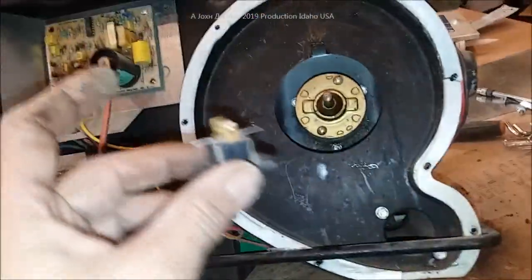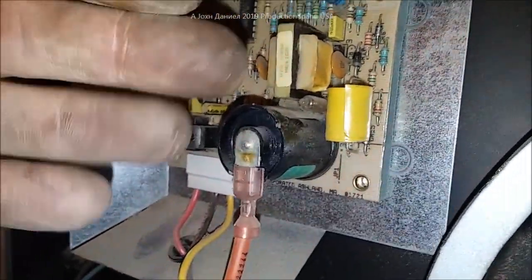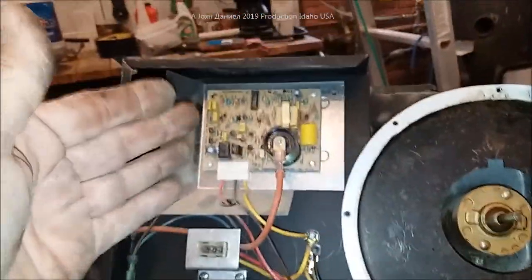Without that little item working right, nothing on your furnace will work. If you're wondering whether your igniter is working, there's a little neon bulb right over here — you can get a mirror, reach up inside the cavity, look in the side of the grill, and you should see it flicker. That tells you yes, your igniter is still working but other things are failing.